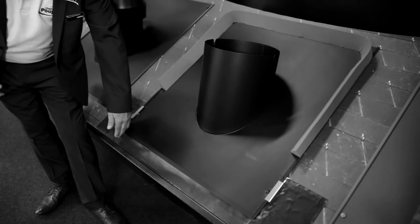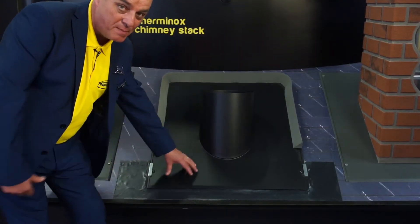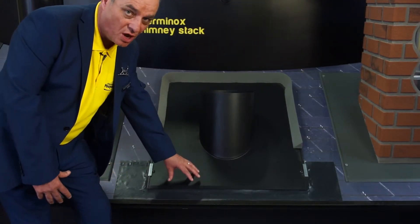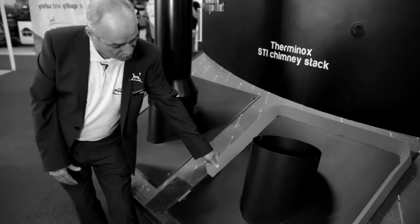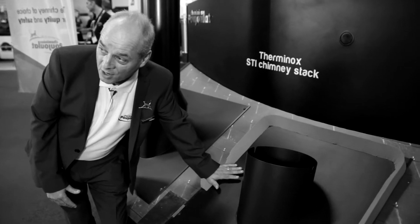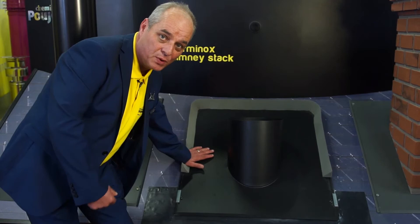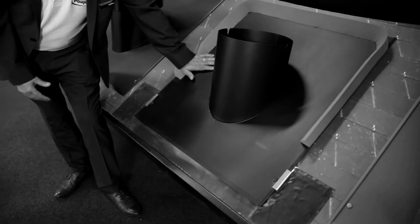It runs down and onto the tiles below. It comes with a glued mastic malleable strip that allows it to be formed directly onto the tiles below. It comes with a foam strip so you don't have to use sand and cement — you can just pad your tiles straight down onto it and get a weathertight joint. It's plug and play, rather than having to spend an hour putting sand and cement and sealant around your flashing plate.